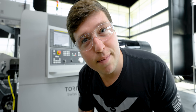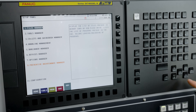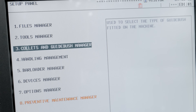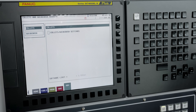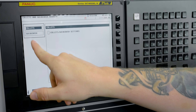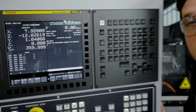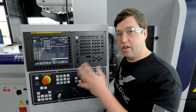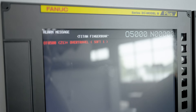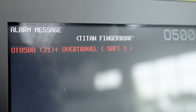Before we jump into the machine, let me show you the collets and guide bushing manager in our TMI screen by pressing Custom 2. In the Tornos machine interface, we can go down to our collets and guide bushing manager, press Input, and we'll have two different menus to choose from: collets and guide bushing. The collets menu is the first thing we're going to set. This puts the machine into a constant alarm so anyone who walks up to the machine will see that you're in the middle of changing the guide bushing over. It will also allow you to travel in and out of the over-travel range that is set when you're in non-guide bushing mode.